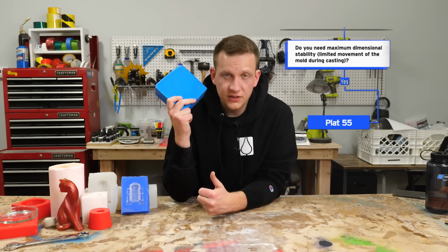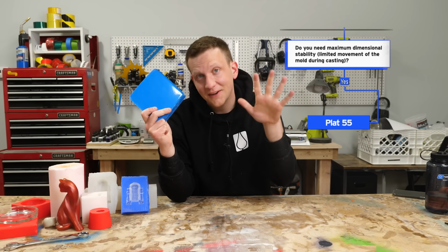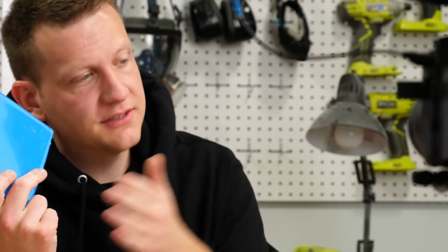Now, Plat 55 is our choice because it's a 55, I know, big leap, but it's a 55A on the Shore A scale. And if you remember, that's further up, which means it's pretty stiff.